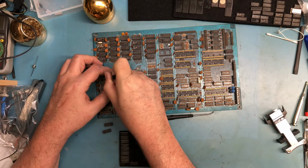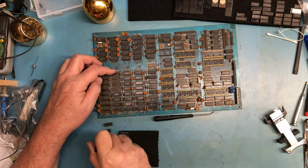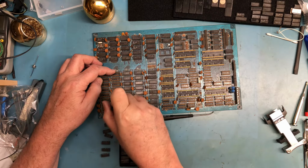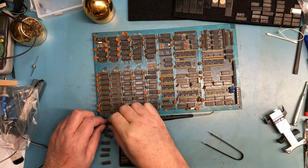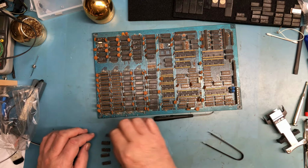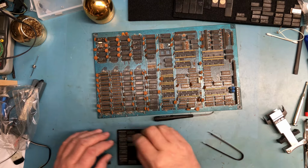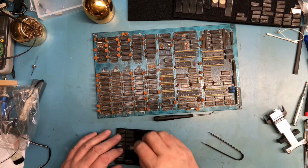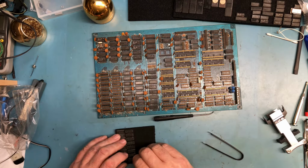The troubleshooting guides don't seem to be all of that. There's not much material in what they have. It is pretty obvious, but we have all kinds of options available to us, including things like we did on the system design system, where I forced a known-good ROM onto the bus and just kind of watched everything run as it ran through the full address space, and was kind of able to confirm the CPU group, the chip selects for the RAMs, etc. were working. And that ultimately turned out to be a solder bridge.